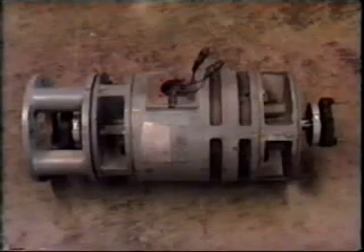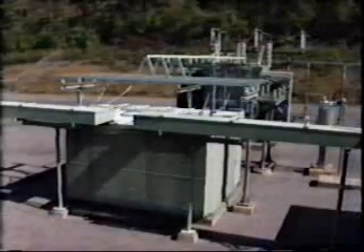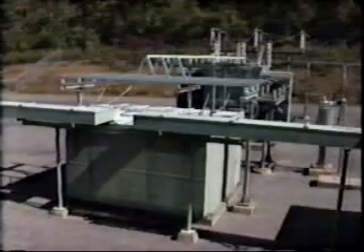The torque converter, which is usually in place here, has been removed and is to be overhauled. The opportunity has been taken to overhaul the atomizing air compressor motor. A major inspection of the turbine will usually include inspections of the auxiliary equipment. The lube oil system, control system, starting system, instrumentation, gear boxes, and load equipment should all be inspected, cleaned, and calibrated during the major inspection.